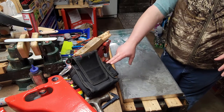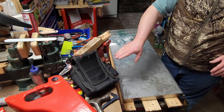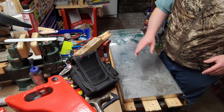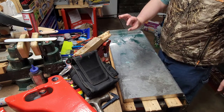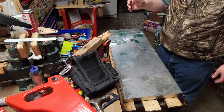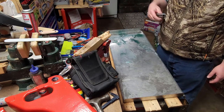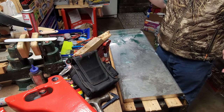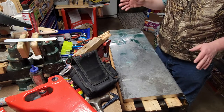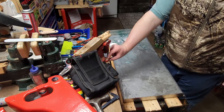The table that you're sitting on is actually three layers. It's plywood, that's permanently attached, everything's attached to that. But on top of that, you've got 3/4 inch MDF. On top of that, you've got 1/4 inch hardboard. And the reason I did that is because as those layers get worn down, you hit it with a circular saw, you pound on it with something, chips or whatever happens, you can easily go back and replace the two top layers